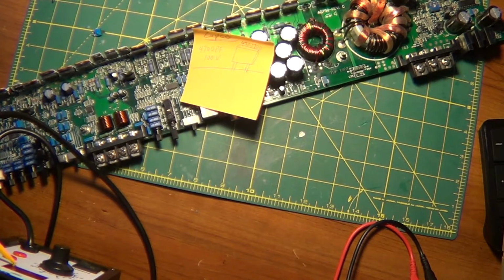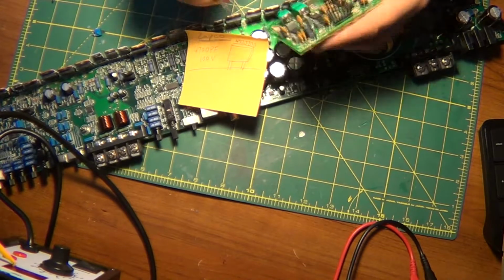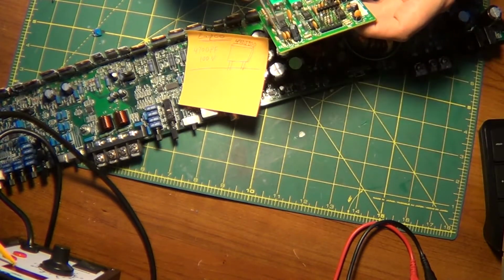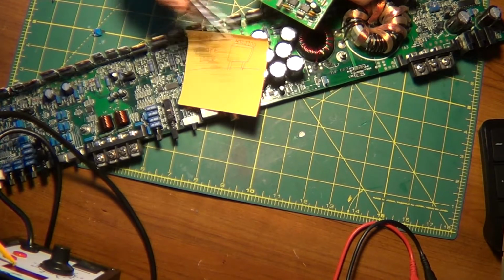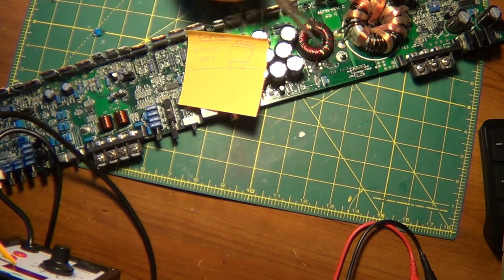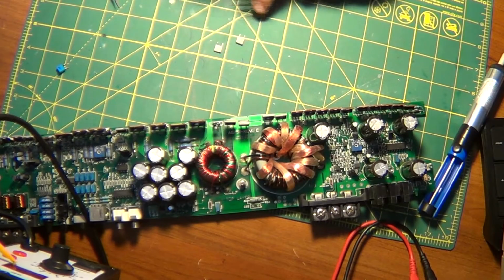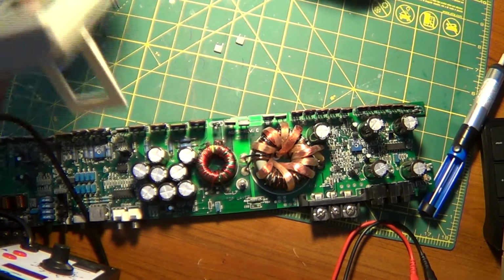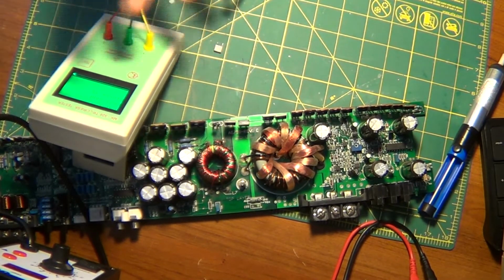It should be ready to rock and roll. So let me get these 2 out of here from this donor board. I'm going to check the value on here, and if it's less than, say, 5%, I will be using this on this board. If that makes sense. Capacitors right there. I'm going to test them out. V-loss, only 1%. So that is awesome.